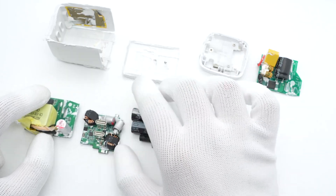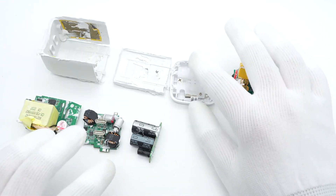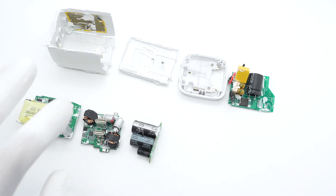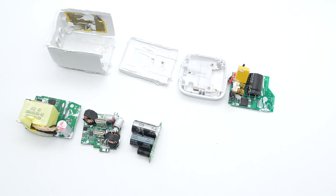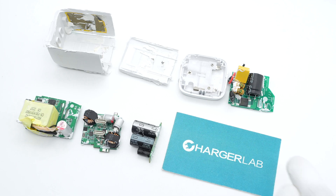That's all the components of the Belkin 65W dual USB-C charger. Compared with ordinary single-port 65W chargers, the extra USB-C port allows you to charge your laptop and mobile phone at the same time. After taking it apart, we found it consists of four small PCBs, with internal gaps filled with silicone adhesives to make it more solid. Two independent synchronous buck circuits mean you don't need to worry about which port is faster, bringing you a better experience. That's all for today's video. Please drop a like, leave comments, and subscribe. See you in the next one!